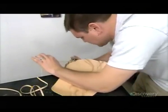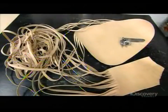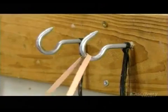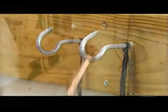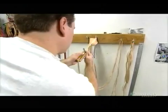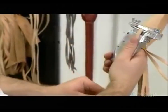The finished overlay and bellies have a flat portion at the top called the yoke, and strands tapering continuously along their entire length. They stretch each strand as much as possible to ensure the braid will be tight and uniform. Then they resize each strand and bevel its edges. This helps the strands fit into each other snugly and create a smoother, gapless braid.